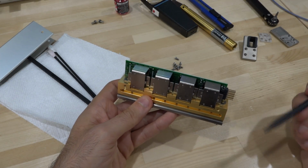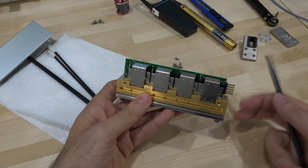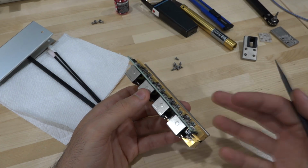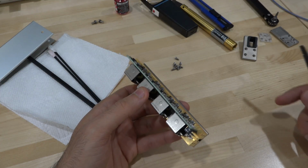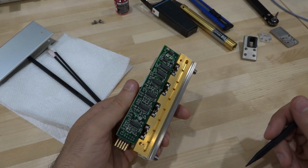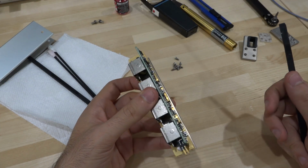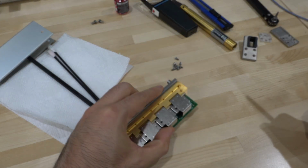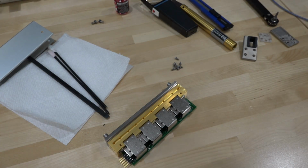I do have a switch controller actually, but I don't have the right cable for it. So we're going to use the equipment to go through the attenuations. It doesn't matter that this is not inside the instrument. It's going to fail all the alignments at startup, but that doesn't matter. It will still be able to switch the attenuators, and we can see if the problem is with the drivers, the coil, or the attenuation section itself. And I'm eager to find out.